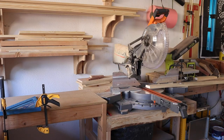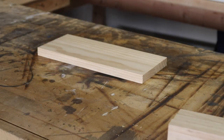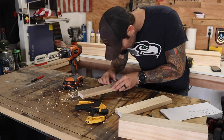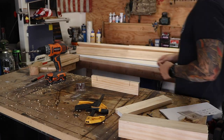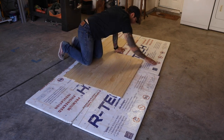All the pieces have been cut to length. I'm laying them out to check the proportions. For this project I decided to do something I've never done before — use dowels to join the wood. Dowels are little cylindrical pieces of wood, and you use a jig to drill holes so one half of the dowel goes in one end and the other half in the adjacent piece. They also prevent the boards from sliding while you glue up.